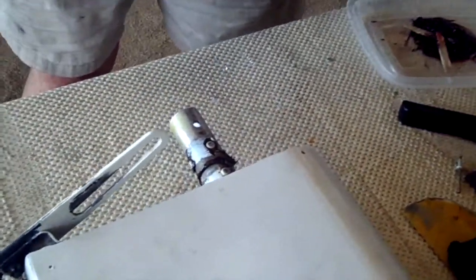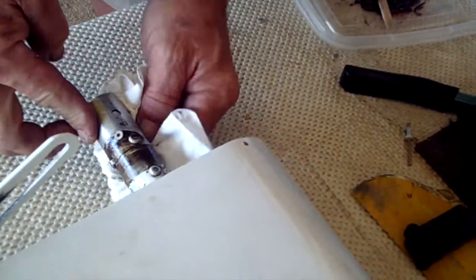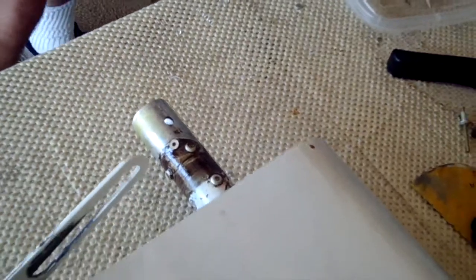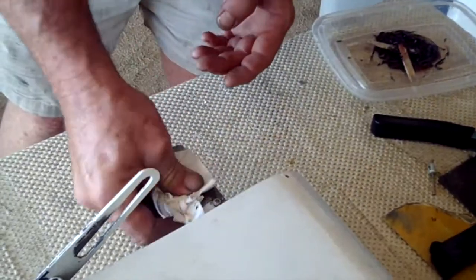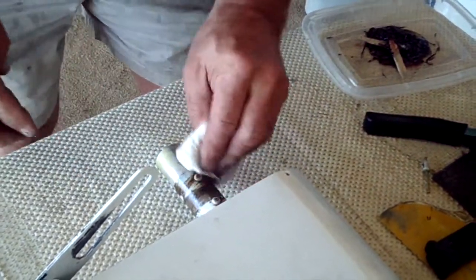But by doing it right now, we won't have to redo this one. So now we're going to get some rags and we're going to clean up all the solvent, the extra, and then we're going to let it cure for 24 hours. Then we'll mount it back on the airplane, and that will complete this repair. It will need a 337 because we did do a major repair to a control surface. So hope you found this informative. Thanks for watching.